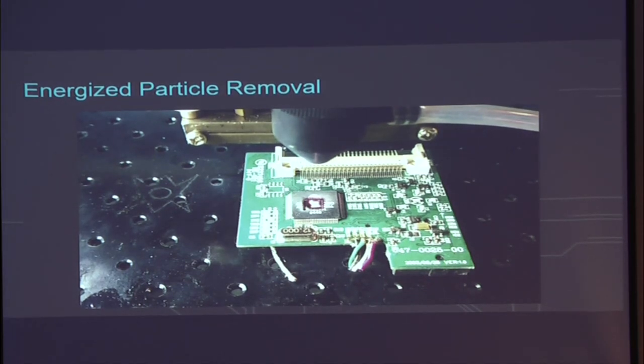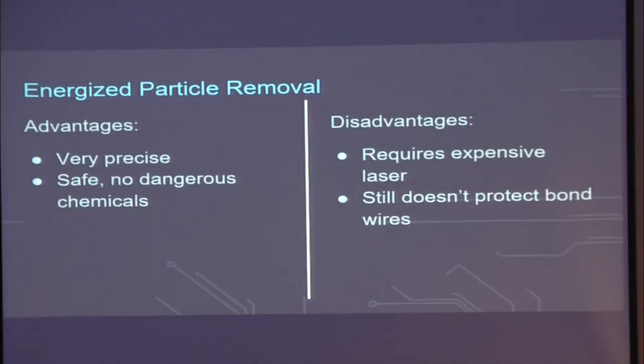This can be a dangerous process. It requires a fume hood and a heating plate. What I was really trying to do with this entire project was make it so that anybody could do it. And it requires some chemistry knowledge, which I don't have. Another way that everybody always suggests is a laser cutter. Energized particle removal works just fine, but it basically falls under exactly the same upsides and downsides of mechanical removal — it requires expensive tooling, it doesn't get you that close, and if you ever want to use the chip after you've decapped it, when you're lasering onto the top of this thing it's actually going to blow out portions of your IC. The silicon substrate itself has a photoelectric effect — it's like the opposite of how an LED works — so if you're blasting light into this thing, you can blow out channels on your transistors. Maybe we just want to look at it, and we really don't care how the chip works.